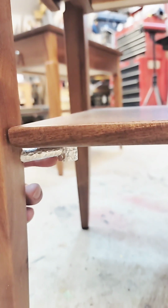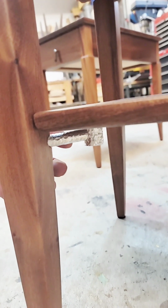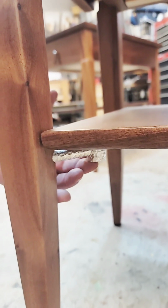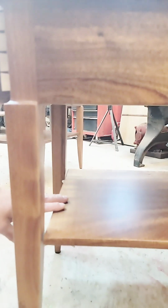And this is cold fastened, just threaded and tapped, not welded. And then I do all the texturing, and then I thread and tap it together, and then I re-drill out so I can get my screw in here accordingly. And it's very strong in terms of this shelf. So I could actually pick the piece up. I wouldn't recommend that, but I was really happy with that.